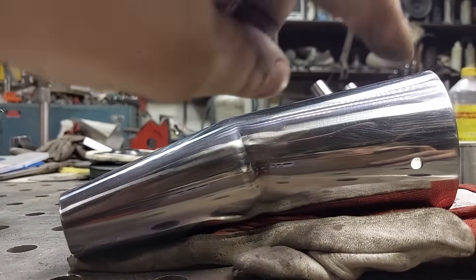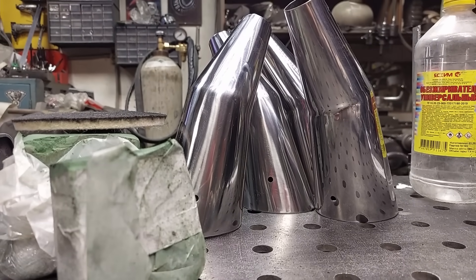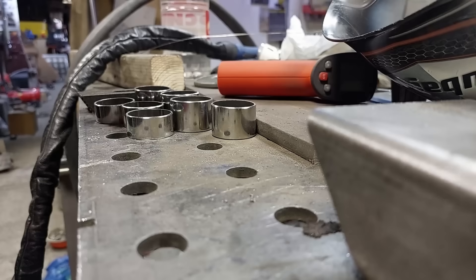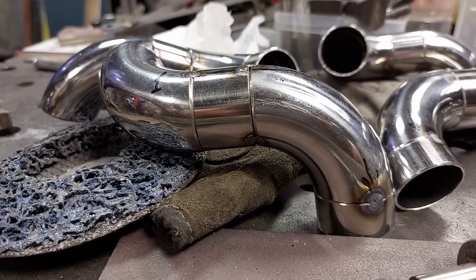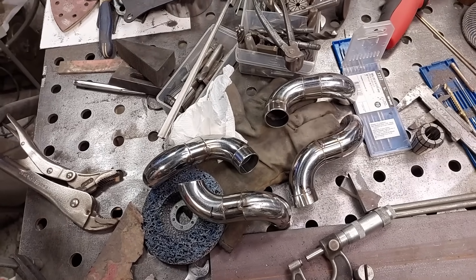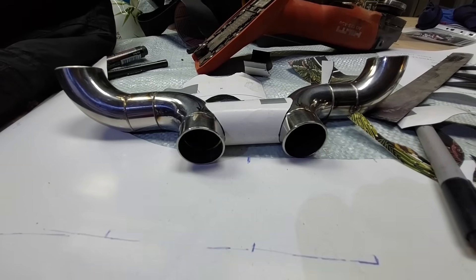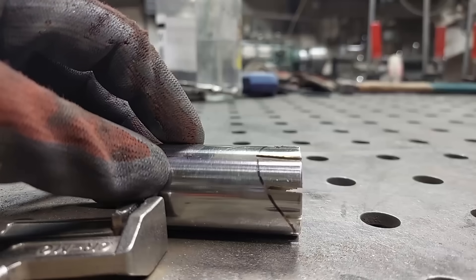Here's the result: shiny, but all scratches are visible. Anyway, I decided to leave it as is for a while and to move forward to exhaust pipes. So we need some stainless bands and pipe pieces – together they form some zigzags like that. What we have to add is some H-pipes. They connect two separate mufflers together, so the shockwave has double volume to spread. This makes the sound lower and quieter.